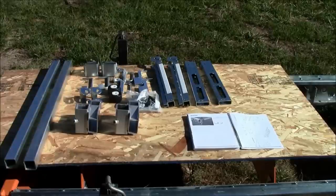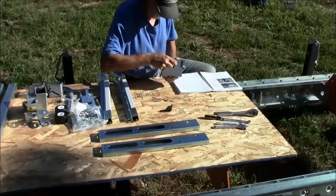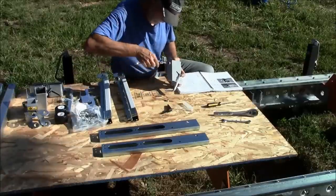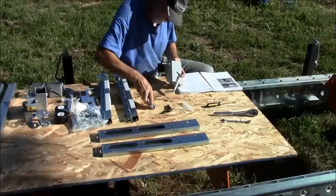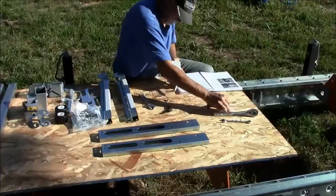Follow the instructions closely when assembling the clamps and the log stops. It isn't difficult, but there are a lot of parts to put together. One thing to watch for here is that the pieces were powder coated after the threads were tapped in the brackets, and you may need to clean them out with the included 1/4-inch 20 tap. Vice grips make a fair handle for the tap, but a regular tap handle would be much better.